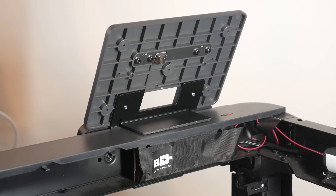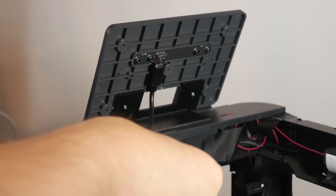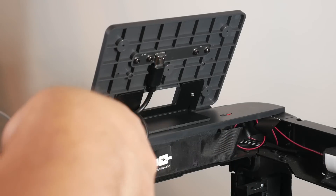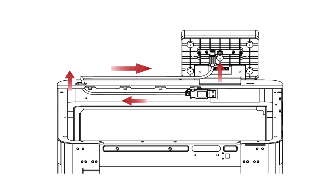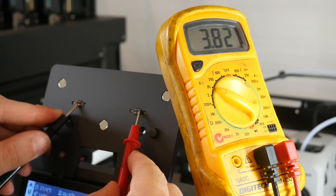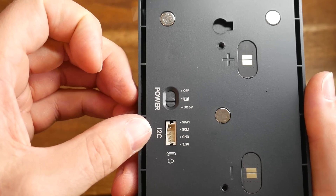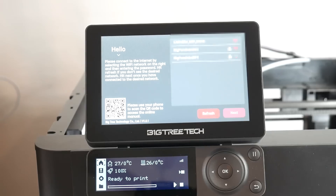Finally, we need to connect the USB-C input on the base to a 5V power source, and the P1 series thankfully has a USB port set up for just this, built into the top of the printer. There are also little clips to assist with cable management. If you have a P1S or an enclosure, the cable is meant to be long enough to reach the hole in the corner. You can optionally probe with a multimeter to test for 5V on the docking pins. We then switch the power on the back of the Panda Touch to 5V DC and place the display in the dock, where it powers up and enters the setup phase.